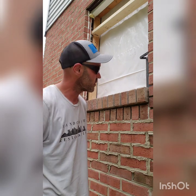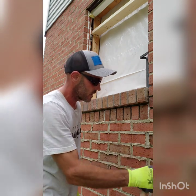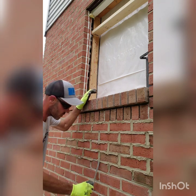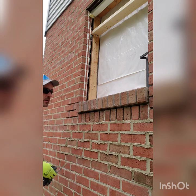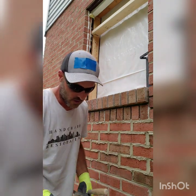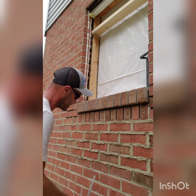As you can see I got it all in there. Normally what I like to do is take the next size tuck pointer up — it's not a huge difference, but it's enough that I can go and just kind of finish those off. It's starting to set up here even though I wet it down pretty quick. In historic work, your mortar joints are real rough just from years of weather and age. So people will take a wooden dowel or cut a broom handle down — a lot of guys use the ends of their tuck pointer — and just kind of join it with that, which gives it that rough texture and appearance.